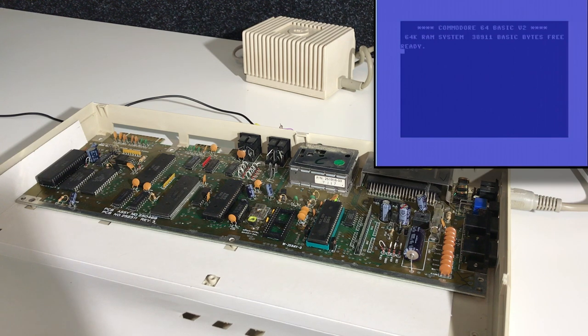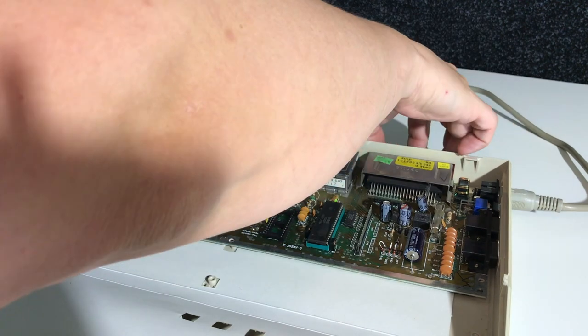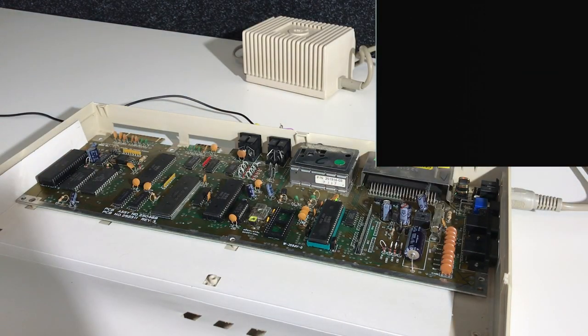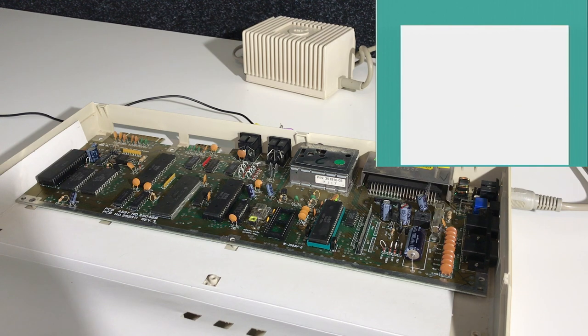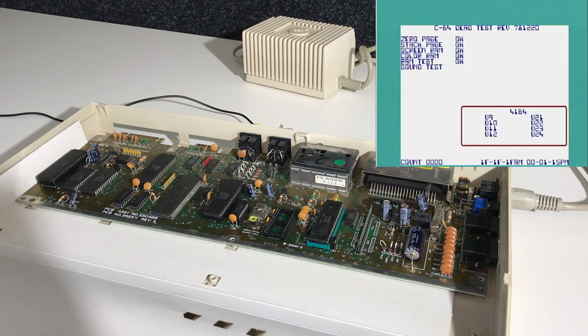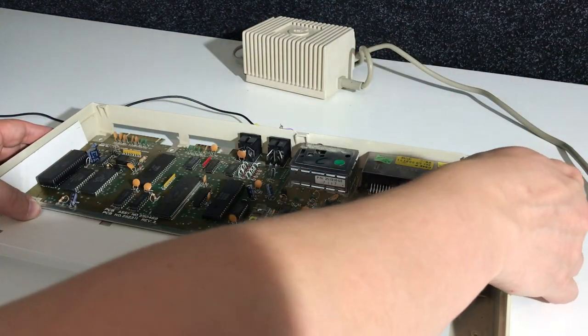Now, by swapping this broken chip into U1, we can expect the keyboard not to work. But to be very sure now that the chip is actually not working, we can run the dead test cartridge, because in the dead test cartridge we have two clocks. Because the CIA chips both contain something called the time of day counter, which is really a time since power on. But because there are two chips and they both have a counter in them, we can see if they are synchronized or not. The dead test cartridge shows this at the bottom of the screen, and this gives us a very easy way to see that one of the CIA chips is not behaving as it should right now.